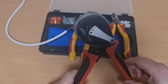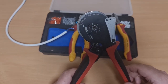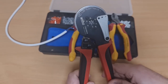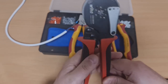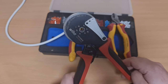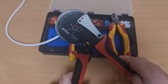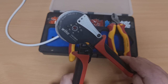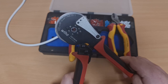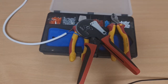Looking at the crimping tool itself - you can see it's rated up to 16mm². For 16mm² you'd move the gauge out of the way since the gauge indicator only goes up to 4mm². If we show it in operation, you can see how it grips down on the ferrule without too much force - it's a nice tool to operate, feels a bit more weighty than the budget one. I haven't been able to find the budget one - it's been pinched. This is the Z6200506, made in Germany, rated from 0.08 to 16mm² conductors, or AWG 28 to 5.